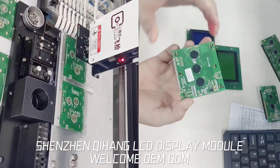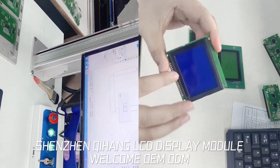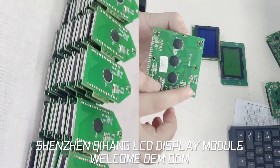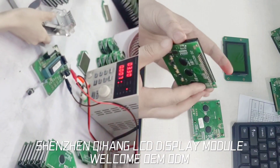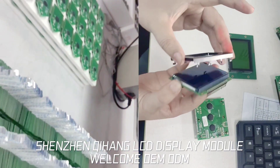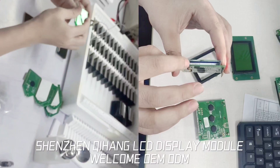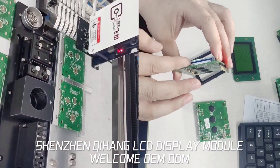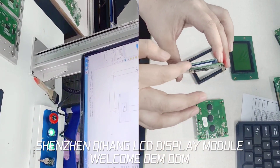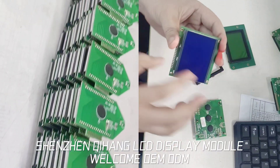Let's take this metal frame LCD module as an example. You could see there's a metal frame outside the screen, and it is held by the metal foot here. Here are two products that are assembled. You may see this metal frame is holding this glass — this screen glass. And you could see the inner panel is the lighting source. We call it LED lighting — just here is the LED lighting. It connects to the PCB board. So this is generally the structure of a LCD module.